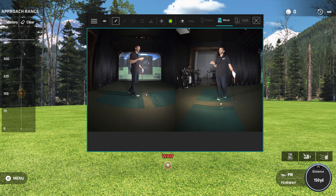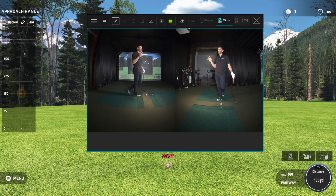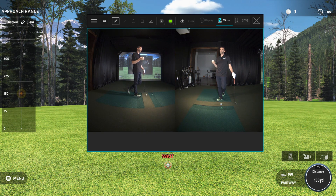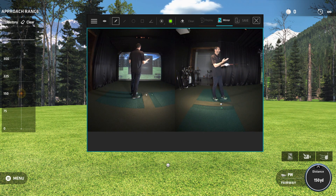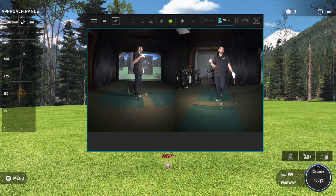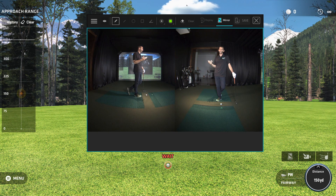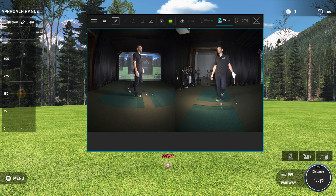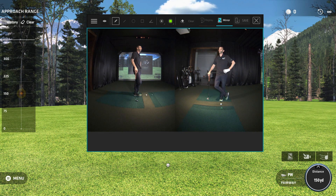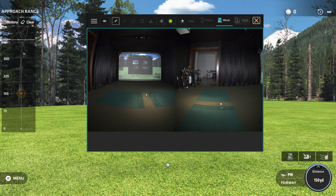I've only had these set up for a very short period of time. I just got them hooked up and tuned in the focus and color a little bit. In my first look video I had some pulsing with lighting — I understand how to match refresh rates so now everything is solid color with no flashing. That happens when the refresh rate of the lights and the refresh rate of the camera don't match. If you need help with that, feel free to email me — that's the benefit of subscribing to the channel.